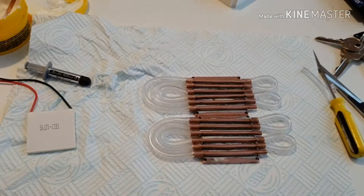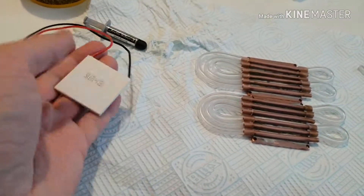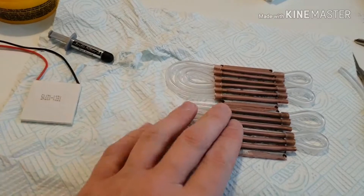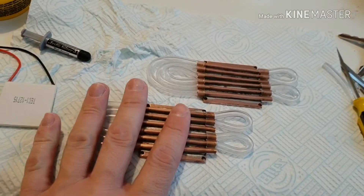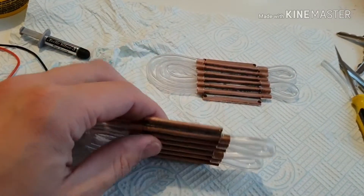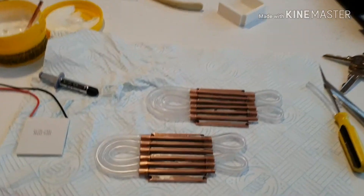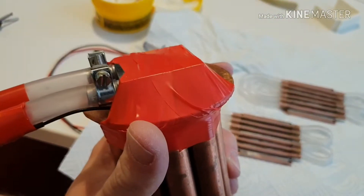So let's build the stack. I haven't bought another £50 Peltier device, so one side is going to be the cheap eBay one, which did work a bit, and the other side is going to be my good Peltier device. I probably won't use the bad one in the first instance — I'm just going to run one side. The calculations I've done suggest that at the maximum speed the peristaltic pump will go, which is ten minutes for one pint of liquid, I only need to put six amps of current through the good Peltier device to get a four degree beer at the end of the day.